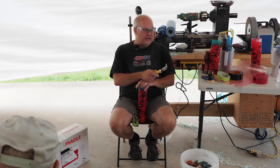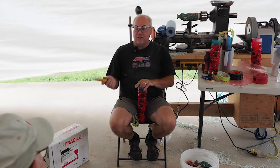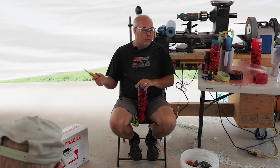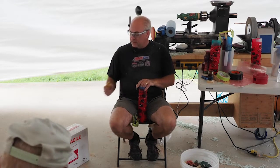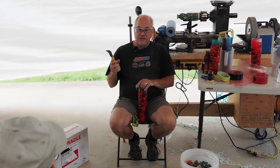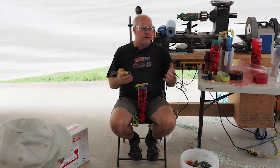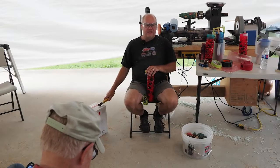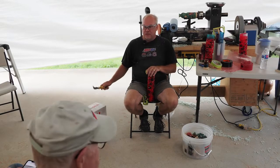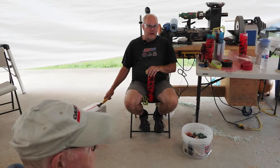When you're selecting your epoxy, absolutely understand what you're buying: minimum thickness, maximum thickness, and what temperatures you should be pouring at. The big reasons epoxy won't set up — especially if it's heat-set — are that your room temperature or the epoxy itself is too cold and it can't generate enough heat to get going. Also pay attention to your mix ratios. There are lots out there that are one-to-one and lots that are two-to-one, so you've got to watch which ones you're using to get the right percentages.